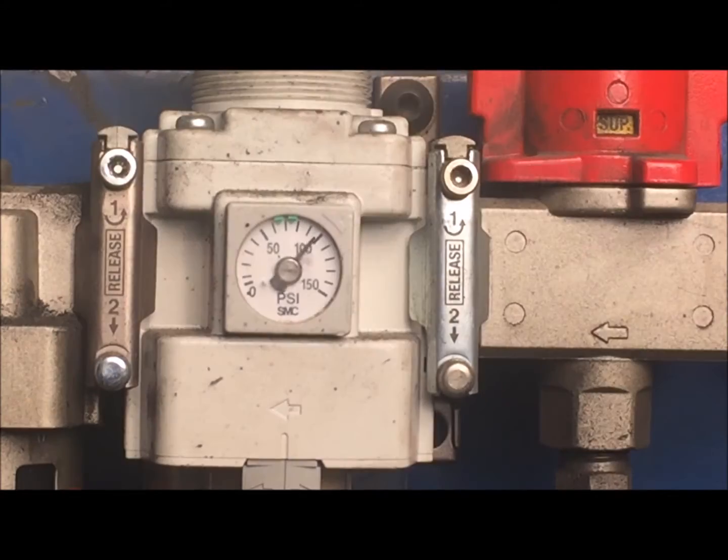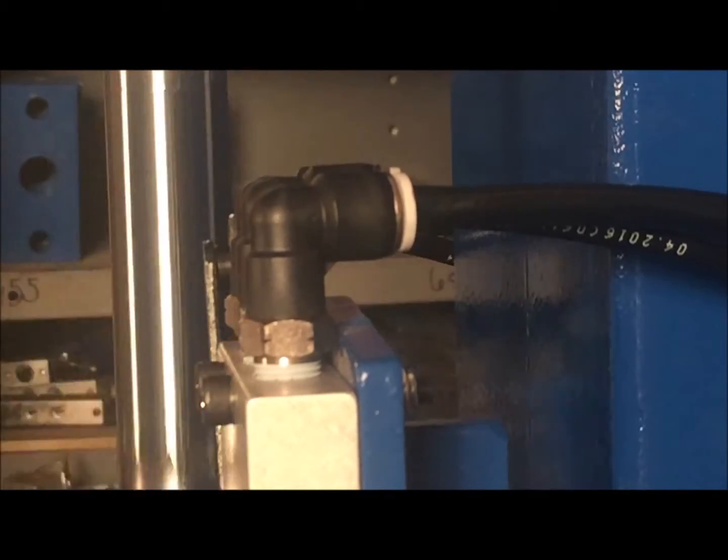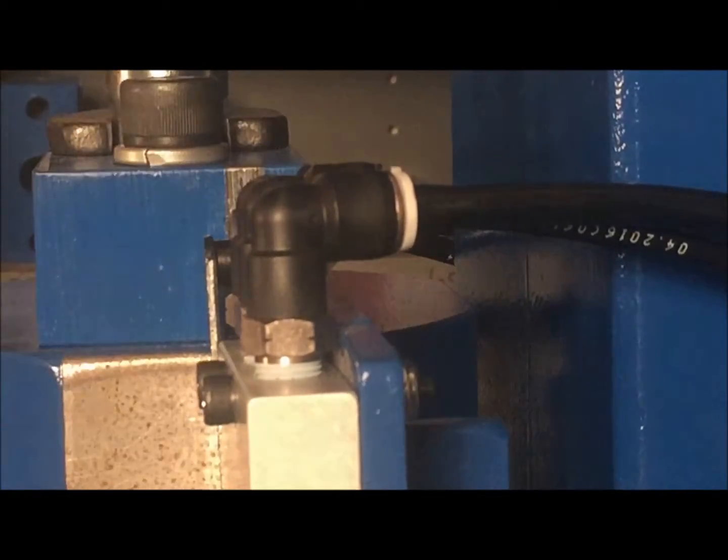The mini valves, the 5-way or spool valve, the cylinder, and the pedal valve. All of the attributes of control — stroke, timing, and power — are derived from these few parts.